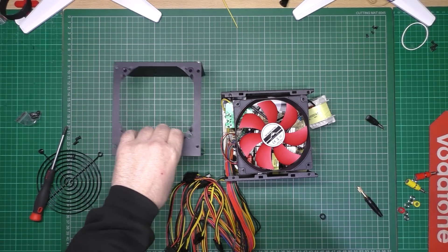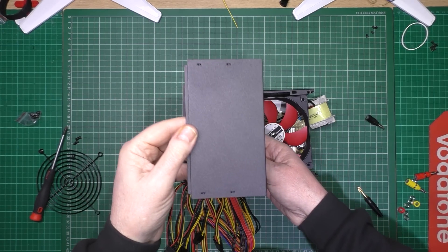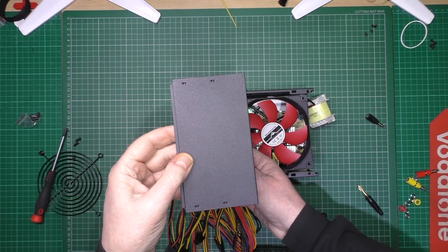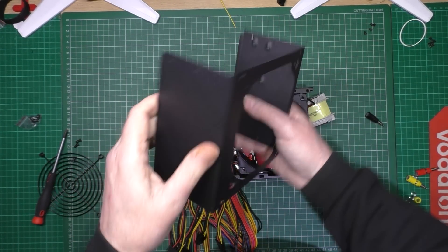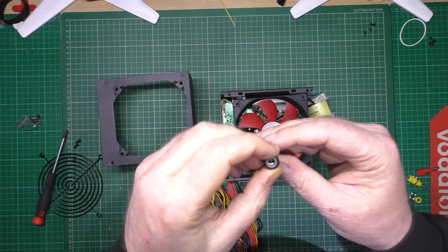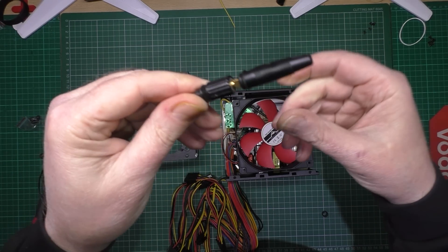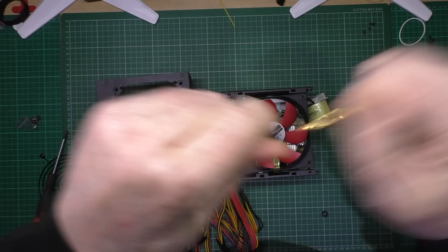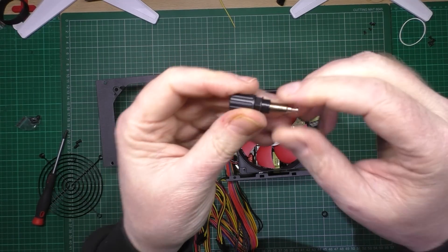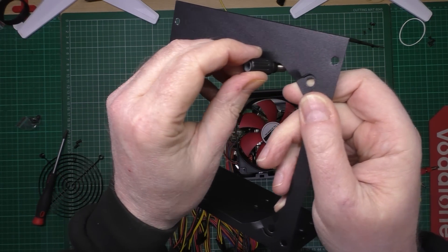So the first thing I'm going to do is take all the casing off, and then I'm going to put some connectors on there so I can make it look professional. I've taken the top case off. I've decided that this is going to sit on its side. The only place I can actually get any connectors is on the top here, which will then become the side. I've got some banana test sockets - so they go in there like that, and then these will go on to your charger. These things have got to go through the case, so I've got to drill a few holes to put these through there, and then I can attach them on the back.